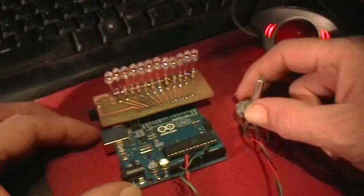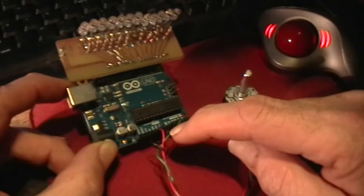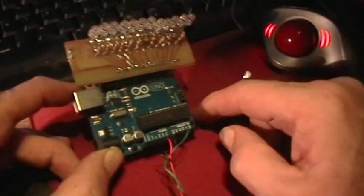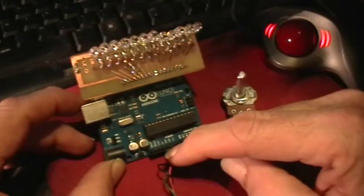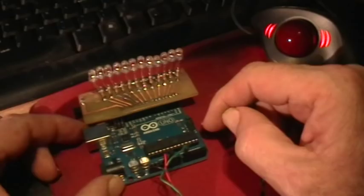and then on the analog side, I have this 50K potentiometer with the pot itself hooked across the plus 5 volt and ground leads, and then the wiper hooked to the analog zero input pin. So there will be a voltage on this analog input pin from anywhere between 0 and 5 volts, depending on where I have the pot set. Okay, so we'll use that voltage as a control input to the program to tell the LEDs to do different things. Okay, so I have lined up the sketches.